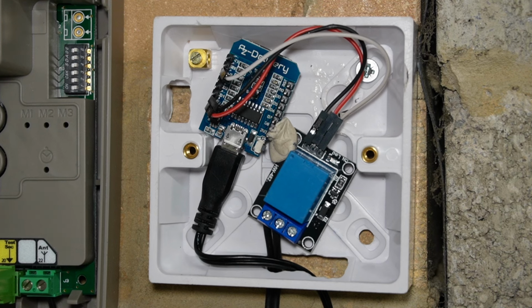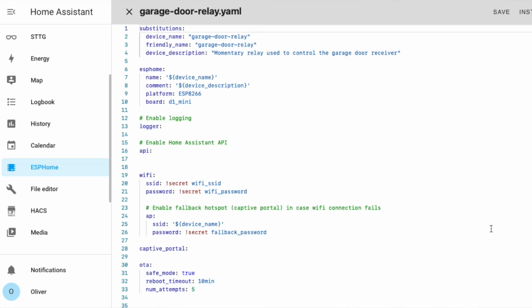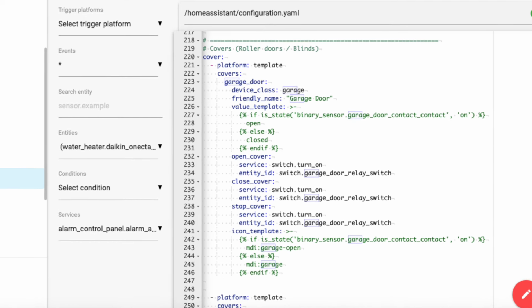In my homemade version, I used an ESP microcontroller with a relay attached to it and loaded a bit of code onto the ESP module that let me control that relay over Wi-Fi from Home Assistant. I then combined those two components, the door contact sensor and the relay, into one virtual garage door device in Home Assistant. The solution still works to this day and has been extremely reliable, and if you want to take a look at that project then I'll stick a link in the description.